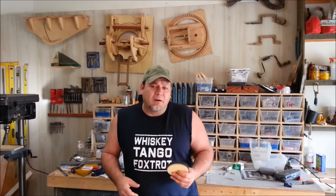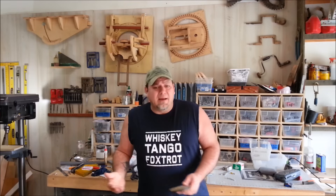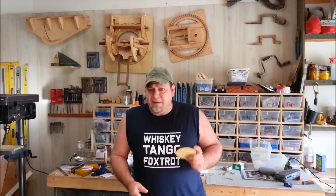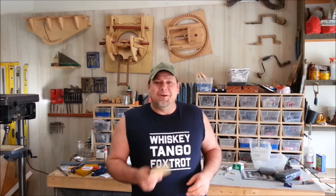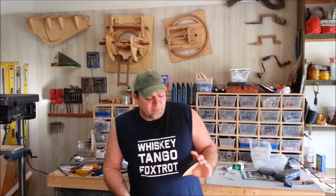There are all kinds of different size gear straps or timing belts out there that will work for this application. This belt I found on eBay and paid about a dollar forty a foot, so it was really inexpensive. A little contact cement or epoxy will adhere it on there nice and secure. They run quieter, you can put a lot more load on them without wearing out, and the math is a lot less complicated — if I want something half as fast, I just make one disc half as big as the other one. Thank you very much for watching, don't forget to like and subscribe, we've got a lot of really fun projects coming down the pipe.